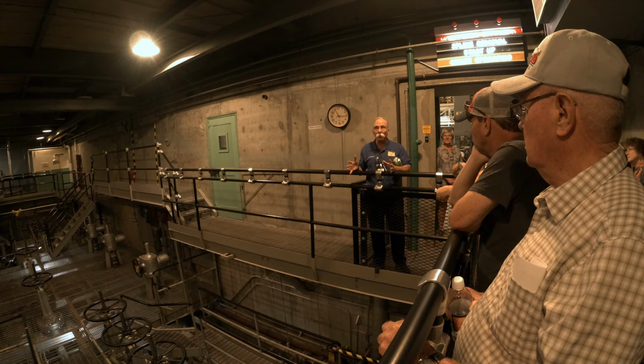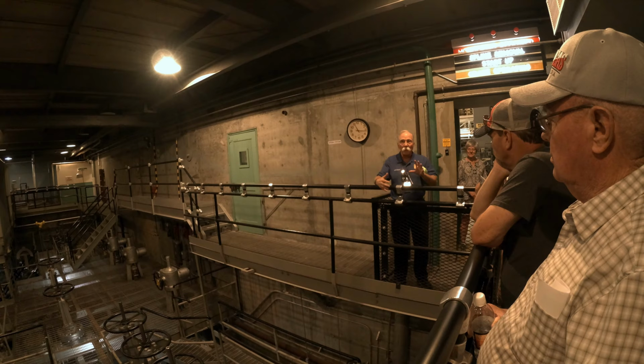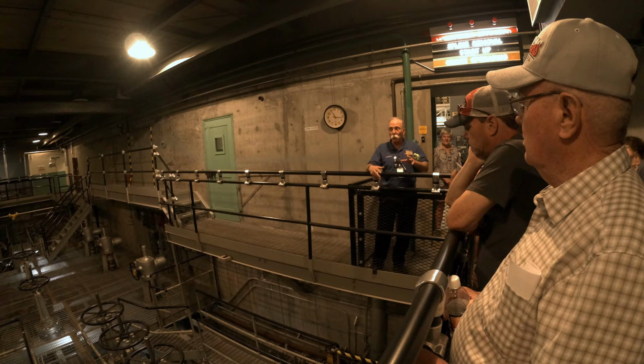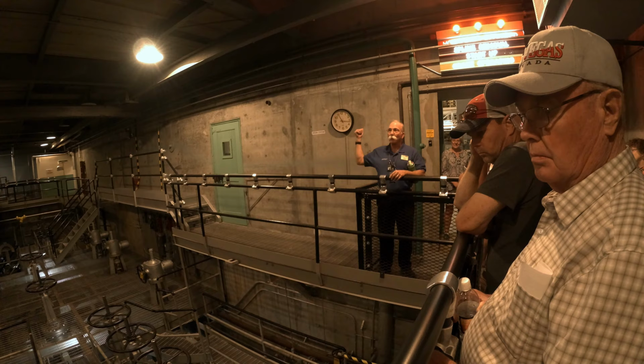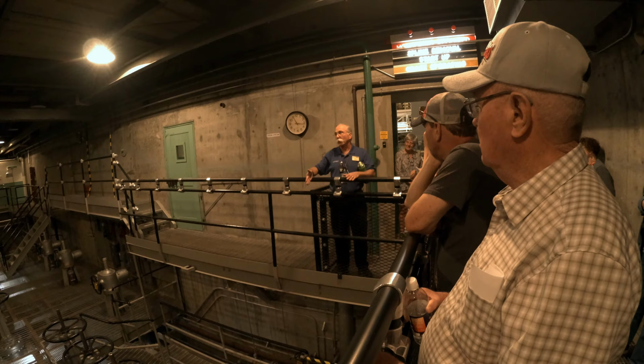The other thing we did is down this hallway here, you'll see an air compressor between the two ventilation units. And there's a big wheel on the shaft that's called the flywheel. Now the reason for that is that, in that case, the compressor, we don't want it to stop abruptly when it loses power. It'll coast down because we've stored energy in that rotating flywheel. So we put flywheels on the pumps in the 190 building for the exact same reason. Those vertical safety rods got to travel 28 or so feet, and it doesn't happen instantaneously. So as they're inserted in the reactor, the power coasts down as opposed to stopped abruptly. So we put that feature on the pumps so they would do the same.